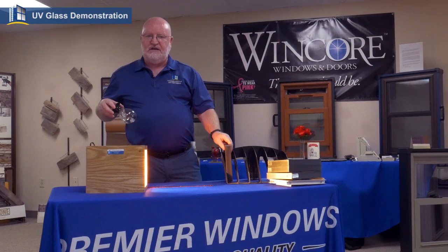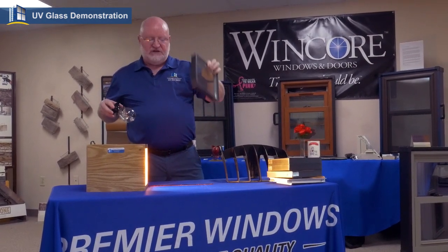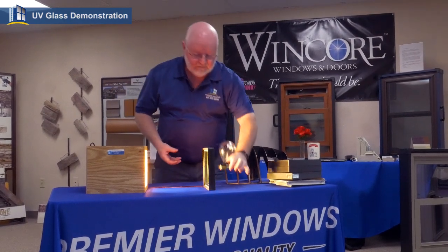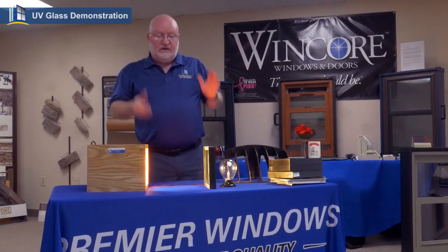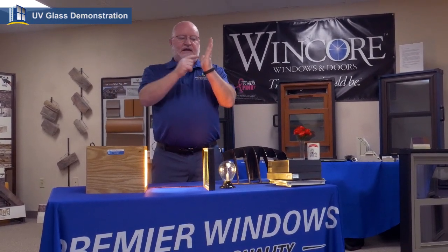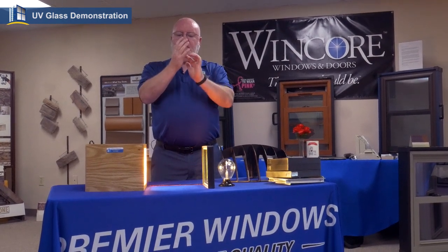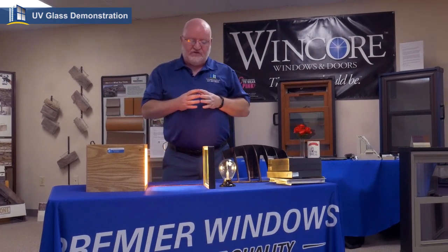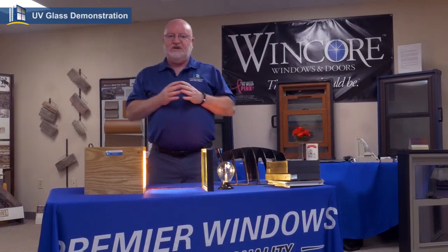And then finally, what we're going to do is reset this and take another option where it's low E. Already you can look at that and tell it's much darker. And what we're going to do is put it back down, reset our little fan, and put the fan back in there. So on this one, it is the second side of the first pane, first side of the second. That has almost stopped. Look at the amount of radiation that's coming away from that.